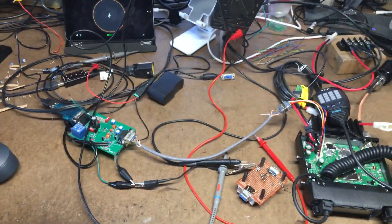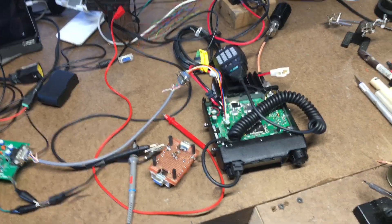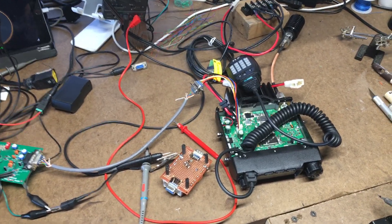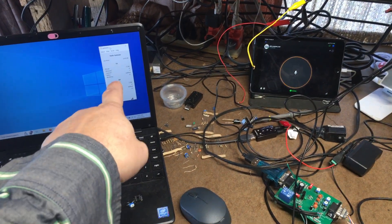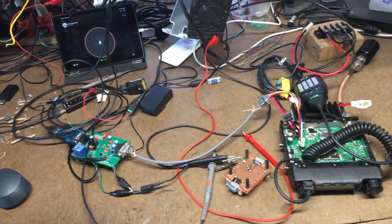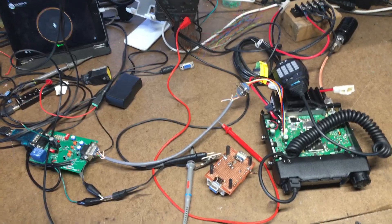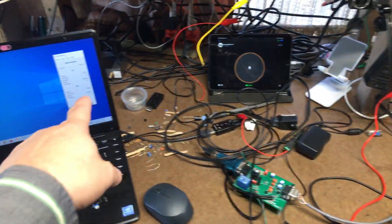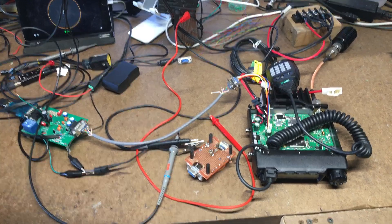That's how you get any repeater online — it could be an old one, as long as you can get within range and program that radio to the frequency. You're going to need hardware to hook it up, whether it's a mobile radio, a handheld, or an actual repeater. It's pretty simple: create your Zello channel and give each repeater a separate username — you can't have two computers log in with the same username. That's why I recommend Repeater A and Repeater B. If you have any questions or comments, post them below, please subscribe, and have a good day!